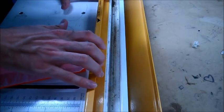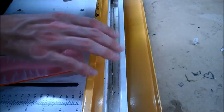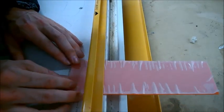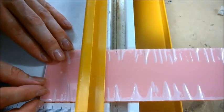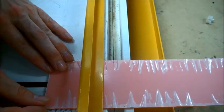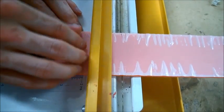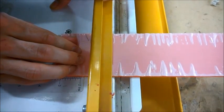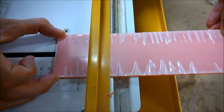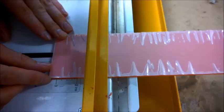What I'm going to do is, with my fingers, just use this guard — which doesn't get too warm — lift it up and pull it back slightly so it sits in a slightly upward position. I can then slide the acrylic underneath and position it. I'm looking for my mark to place it. I want this to be completely level — ideally I'd mark it either side, but I can line it up against this little ruler here to check it's square at 90 degrees. When I'm sure of that, I lift the guard up and push it forwards, and it drops down and grips the acrylic tight. I'm just repositioning it slightly to make sure it's completely square, with the heating element just above where I placed that line.